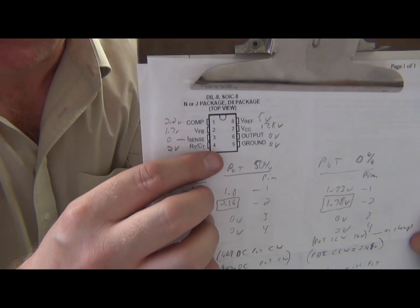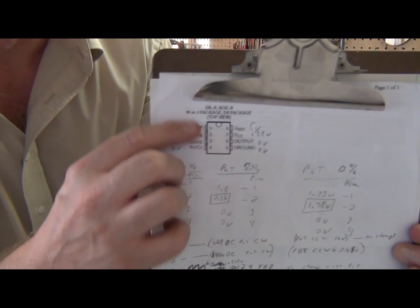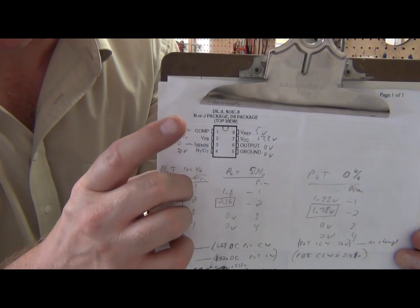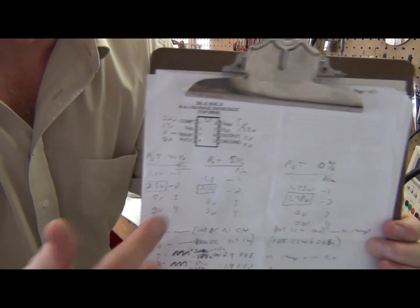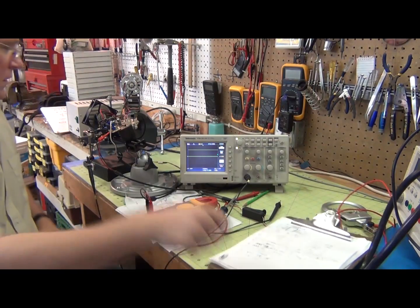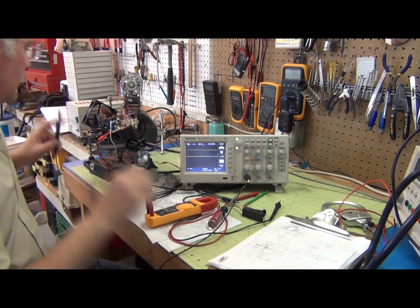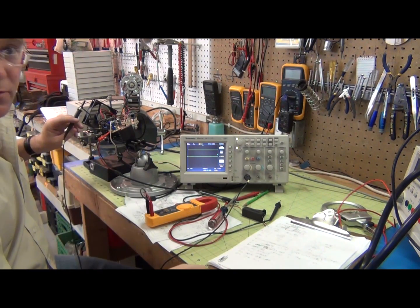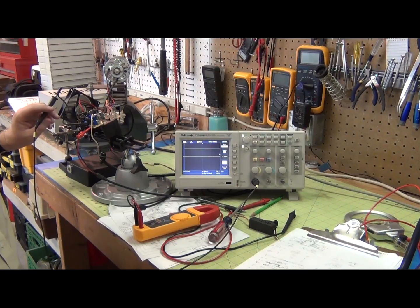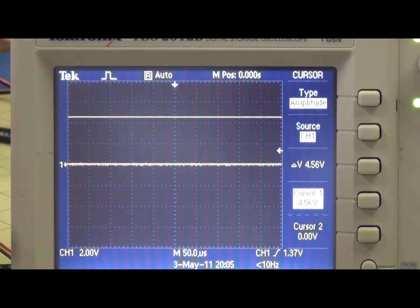Now I'm going to take some more waveforms. Rather than just a voltmeter, I'm going to use my oscilloscope. I'm mostly specifically interested in pins 1 through 4 on this pulse width modulation chip. We did the DC before, but now I'm going to poke around with the oscilloscope. I'll start off with showing pin 3 — let me zoom in on the scope for you, and just watch the scope while I probe pin 3.